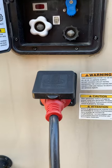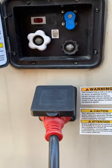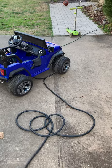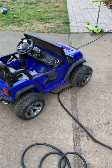Anytime you're about to plug into the RV electrical area, make sure that the breaker on the 30 amp at the RV post is turned off. Plug in your RV, plug the bottom of your RV cord into the RV power outlet, and then turn the amp on.